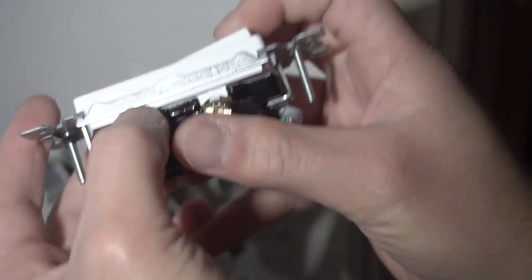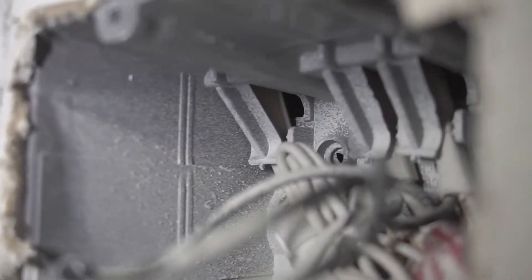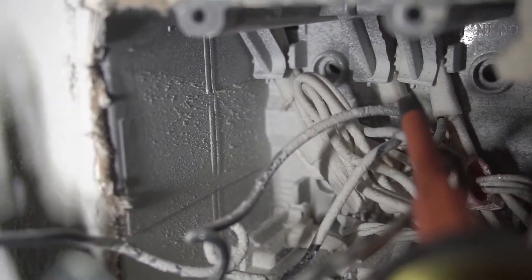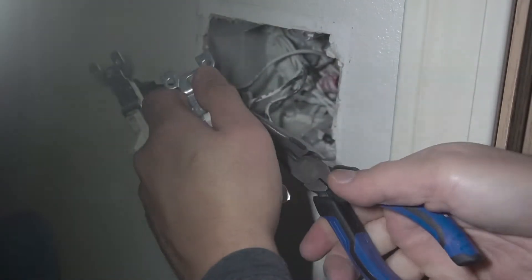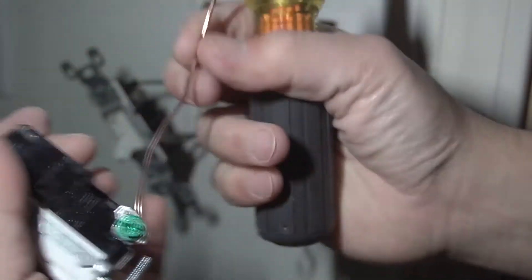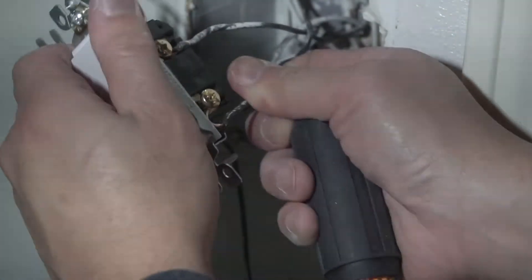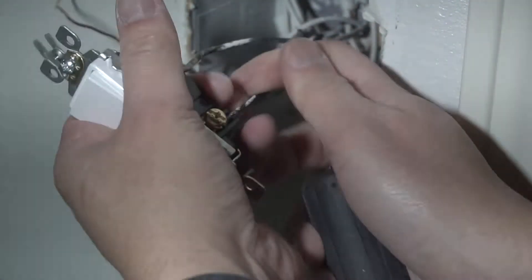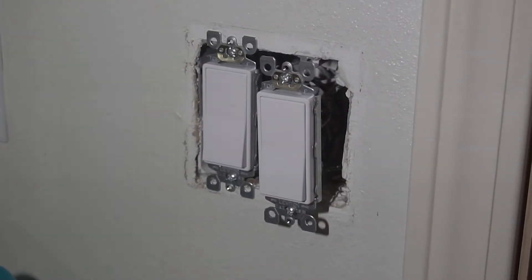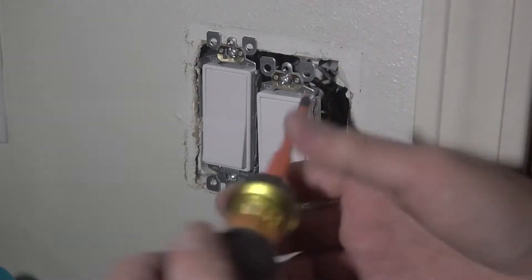The new switch is a 15-amp Leviton with two brass terminals and a ground terminal. This is a plastic junction box, and I want to confirm what wire is running through here — 12 gauge or 14 gauge — because it's hard to tell; I don't know what they spray-painted over it, but it's very poorly done. We confirmed it is 14-gauge wire, so I'm using a 14-gauge pigtail for this switch. Make sure you do a shepherd hook on all your conductors and tighten them in a clockwise position.